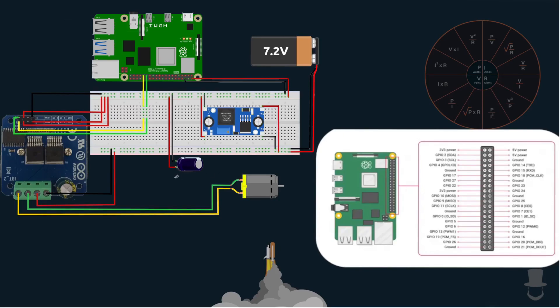To smooth out the voltage a little bit whenever this thing starts pulling more current, I do have some capacitors tied into the 5-volt rail and also the ground. On the other side that's going to be powering the DC motor, you're going to want to hook up your 7.2 volts to the battery voltage screw right here, hook up the ground with this screw, and then the PWM signals are going to be coming out of these two right here, going straight into your DC motor.